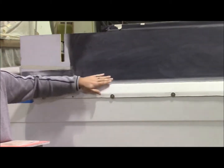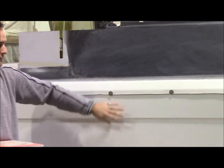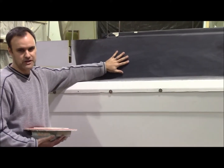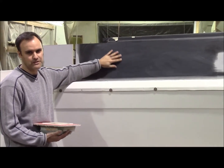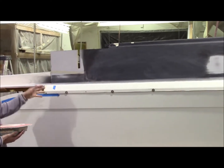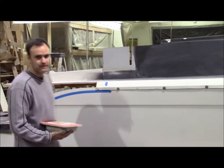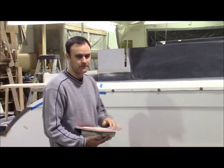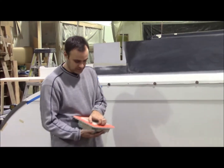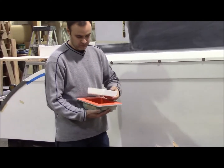The colour is different. This is a white gel coat, different from what we use on the finished products — same as the hull. This is a tooling gel so it's more sandable. That's why we like that. And then the foam — there's not too much foam in here yet, but we'll be using more foam in the transom area for the curved areas. But what I've got here is just a small sample of a mould and the part that we've made.